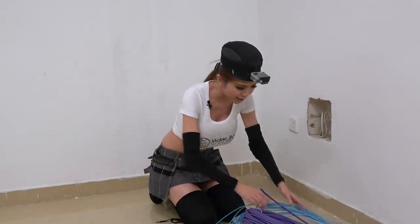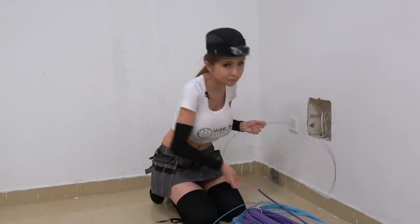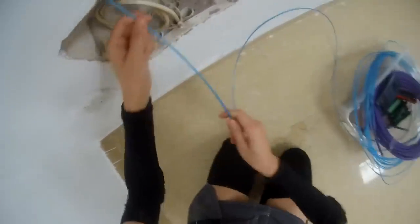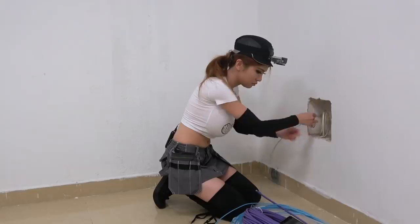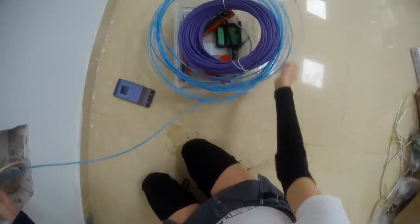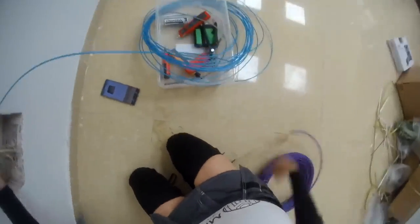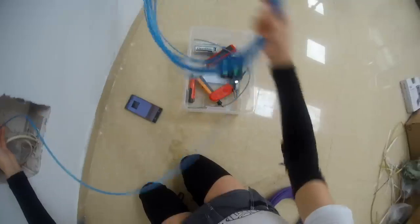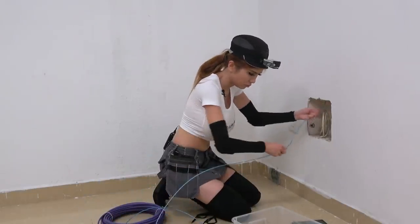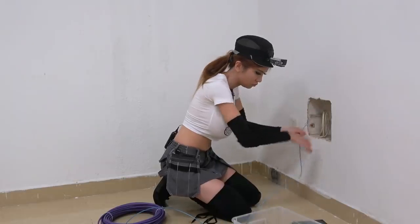I need to get this bit to come out on the second floor. I got this new fish tape because it's just a few dollars on Taobao and my old one was pretty worn. I don't like using uncoated steel fish tape — the mains wiring in China is often really dodgy and you never know what's going to be carrying currents that shouldn't be.